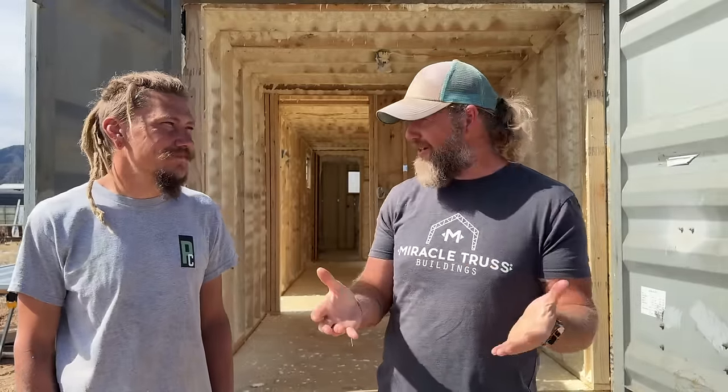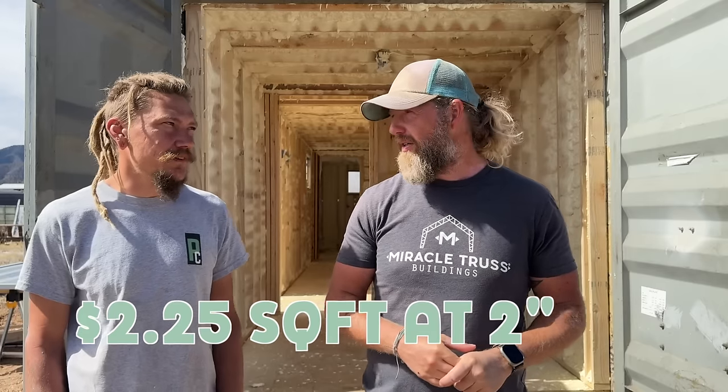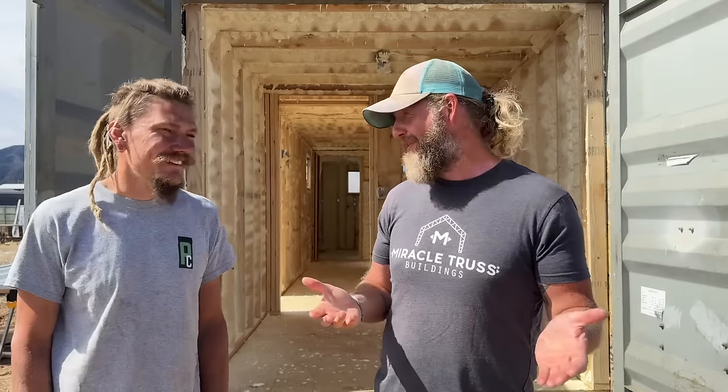Let's talk about cost. The interior foam like what we just sprayed is about $2.25 a square foot at two inches thick. The roofing grade stuff that holds up to weather is three dollars a square foot — that would be for something on the outside of your building, like when you sprayed your dome that can get hit with hail. We don't need that here because we're spraying it inside, but it's good to know. If you're in Cochise County and you need some spray foam, Kyle's your guy — contact info will be in the description.